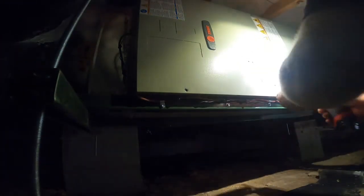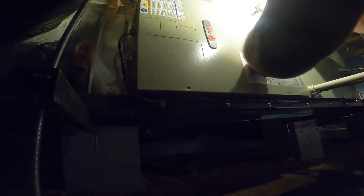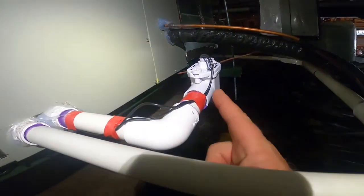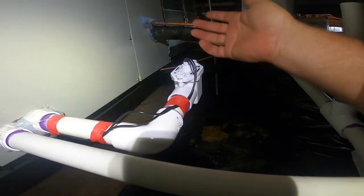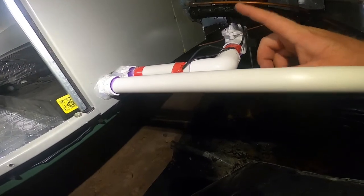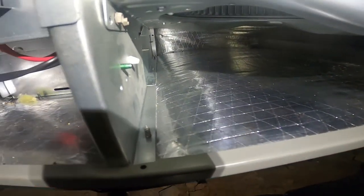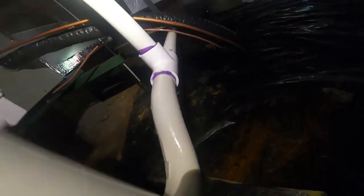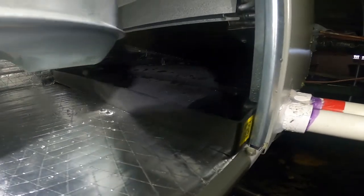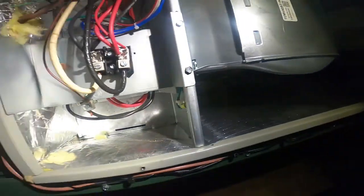Alright, double check the wiring in here for my thermostat wiring - I already know that works because that's how I shut the system down a couple minutes ago. Took that out, flipped it upside down, made sure it broke the circuit to the thermostat. We do put, even in crawl spaces, a water safety switch, because we don't want the water to fill up the brand new air handler if there's an issue with the drain line. Which it's all brand new, shouldn't clog, but put a shut off on it - don't let somebody's brand new equipment fill up and flood with water, that's just lazy.